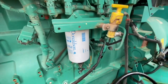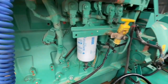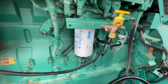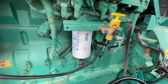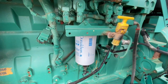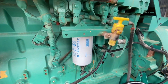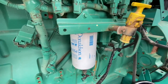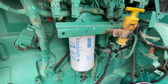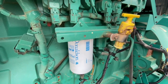After about 30 seconds you're pretty safe to start it. If you don't do this - if you just put a dry filter on and start it up - your engine will start at idle, then you'll hear a couple of loud knocks and it will shut down. That's because you've pushed air through the fuel rail, the engine loses fuel pressure, and shuts down. It's very bad for the injectors; they literally run dry. You should always prime your fuel system first to get long service life out of your injectors.